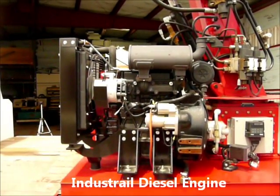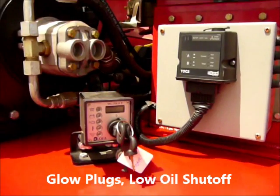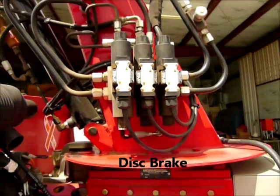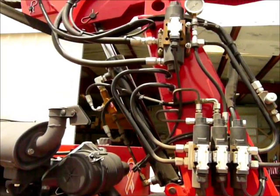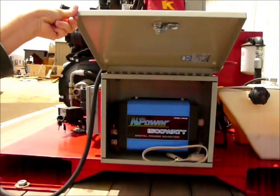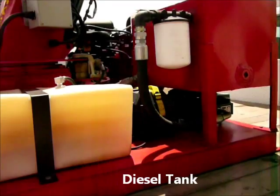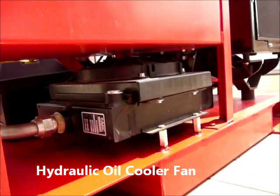This is a Yanmar industrial engine. We also have Kubota industrial engines. They have a heat cycle for cold weather. There's a key on it, and if the oil gets low it shuts off. This is the hydraulic pump. And that's the computer control, which we're not going to demonstrate today — but that will handle the radius, boom, and vertical. Here are the different controls. Everything is made so you can service it in the field very easily. This here is an inverter — 1,500 watts — and people really love that for battery charging in the field for DC-powered tools.